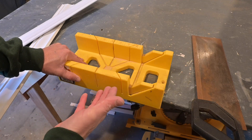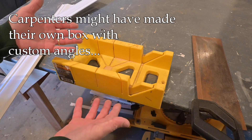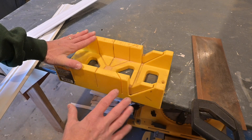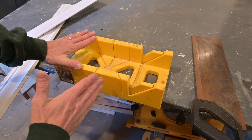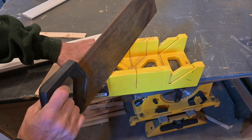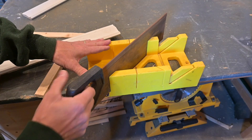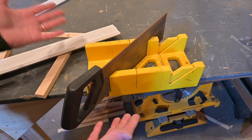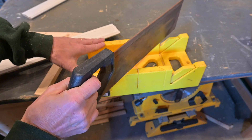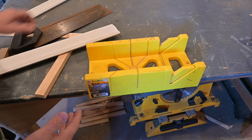As I said earlier, many carpenters back in the day would make their own miter boxes, so they wouldn't be using something plastic like this. This is really a homeowner version of what a professional carpenter might have been using. But there are ways without modifying this of adjusting the angle that we need. This miter box only has a 45 degree angle here, and if I need a 46 degree or a 44 degree angle, that's a problem — I only have what I have here. Now if I was making my own box, I might make one with a number of cutouts, so I could make one at 44, one at 45, and one at 46 if I wanted to. In this case though, I'm stuck with this. So how can I adjust the angle?